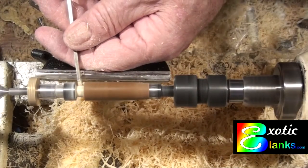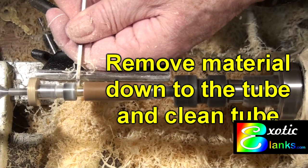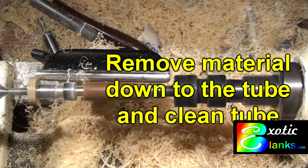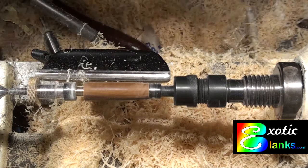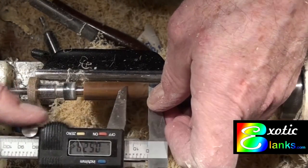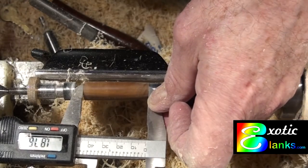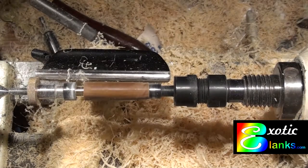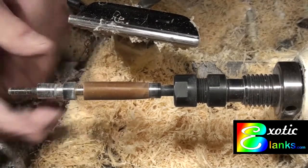Once you've gotten down to the brass, take off some brass. You're going to be putting a spacer on — there's an extra 47A bushing that gives you an extra spacer you can put over the top of that brass tube so you can check the outside diameter of the top of your pen. That is a tight fit, so if you don't take off any of the brass of the tube, your extra piece is going to go on the brass tube with some effort and it really takes effort to get it off. So plan ahead a little bit and take off some brass. Don't worry about it — you're not going to do any damage. Ultimately you're just going to put your center band over that anyway and glue the center band in place, so everything's going to be reinforced without any problem.